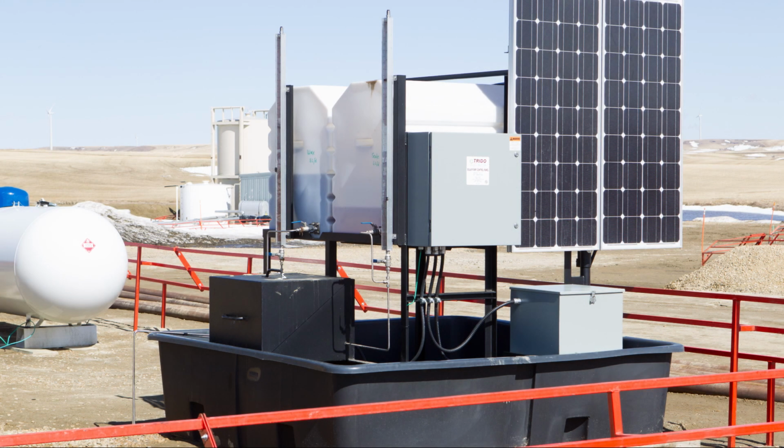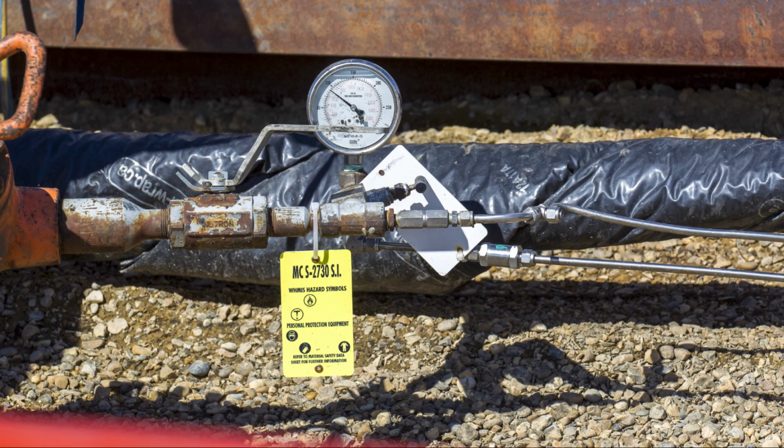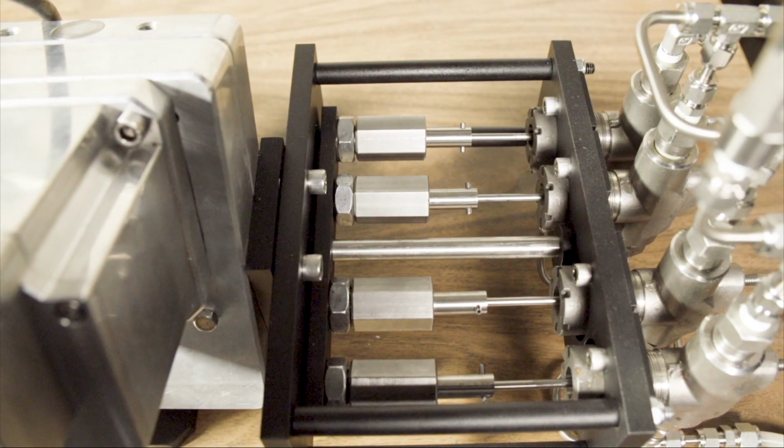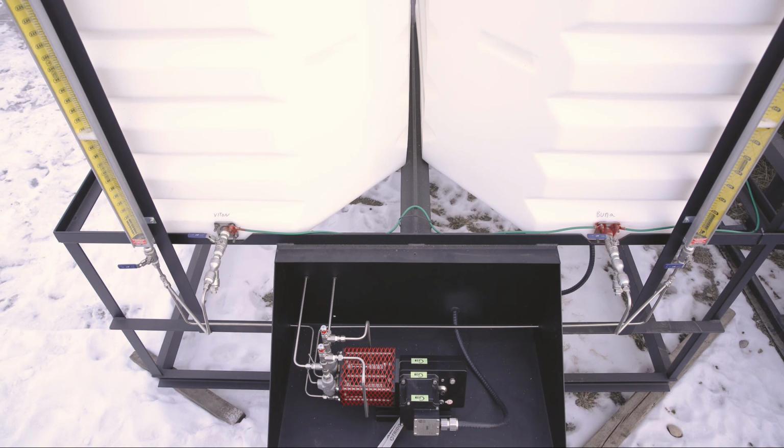When starting the Trido Chemical pump package for the first time, there are a few checks to do before startup. Ensure that all the piping from the chemical pump package to the final destination is complete and all the destination valves are open. Check that the packing nuts on the pumps are tight. Open the valves from the tanks to the pumps and check the piping for leaks.